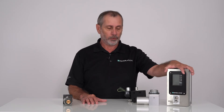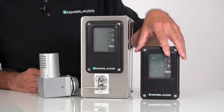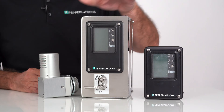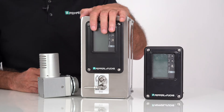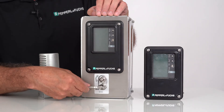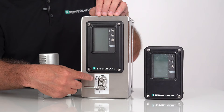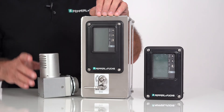If you have a WPSA and filter regulator issue, or you just want to upgrade the 1000-3000 series to a 7500 series system, the 7500-MTD is probably your best bet with a vent. The 7500-MTD includes the control unit and the manifold system. This has a ball valve and needle valve on it — the ball valve is for purging and the needle valve is for pressurization, along with the vent.